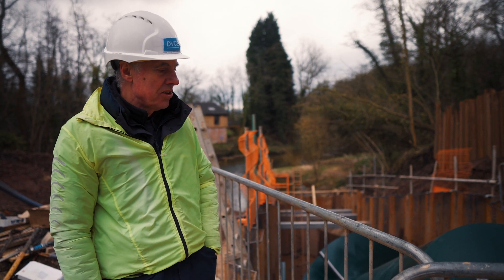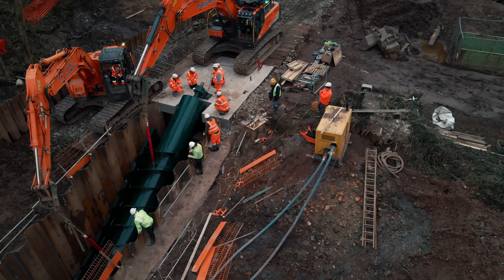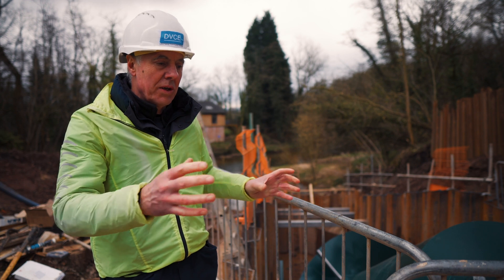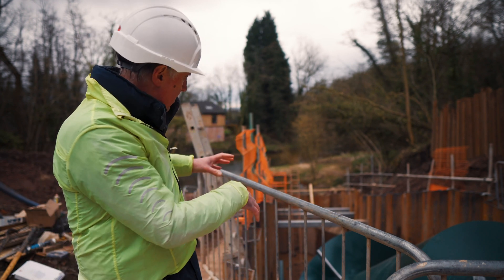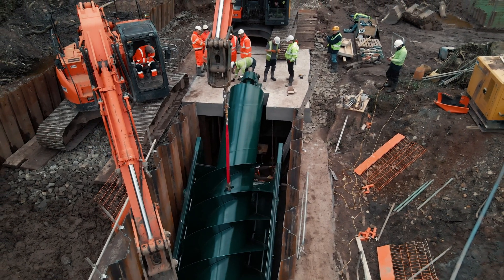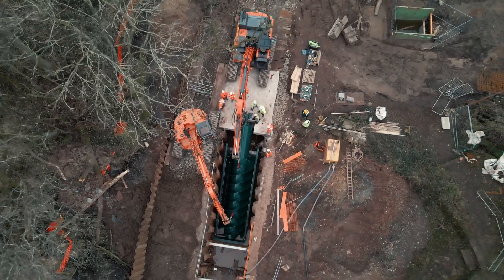The next phase of the operation is to fix this top plate more solidly by applying a grouting material underneath the plate, locking it into position. We'll also take out the protective struts at the bottom bearing, which will then allow the screw to rotate, and finally we'll check that we can manually rotate the screw inside the channel. We'll also take out the shims — spacers currently keeping the flights of the screw away from the trough — by slightly jacking up both ends of the screw to pull out the aluminium shims.